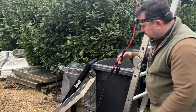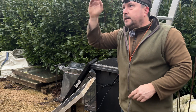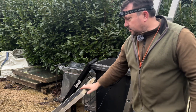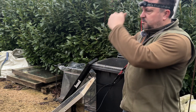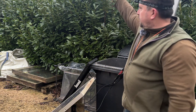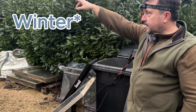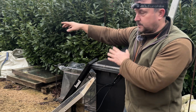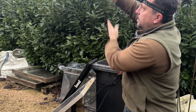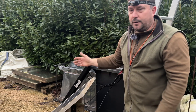They're linked up. For now I've just run the cable to the top of this stepladder, across, and into the building. Eventually my plan is to put an eight-foot post concreted in the ground, rise the panels up to about eight feet, and have a hinged bracket so I can angle them down in winter when the sun is low and push them up in summer when the sun is almost directly overhead. But I'll get around to that another day.